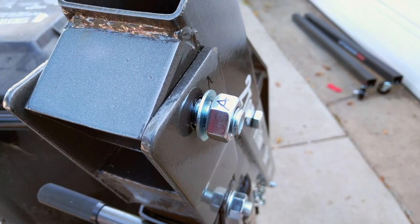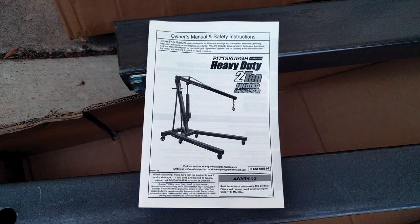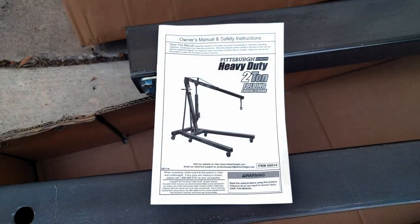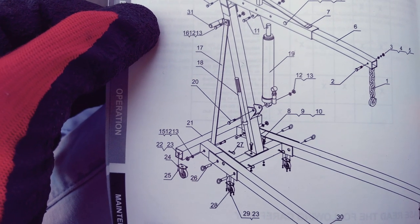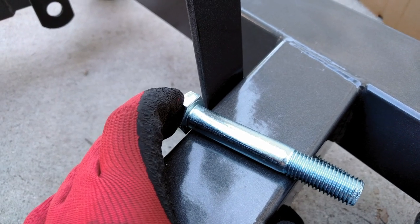I'm not an engineer, nor is this a complete picture of design, but I was surprised to see such an obvious oversight. The poor attention to detail is clear in the assembly instructions, where the bolts holding the struts to the base are inserted from the outside, making the threads bear the shear loads from the strut. However, in the parts diagram, the bolts are inserted the other way, putting the shear stress on the shaft of the bolt — ostensibly the correct way.